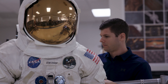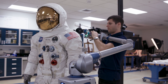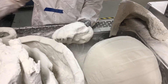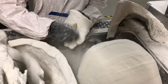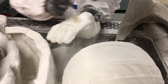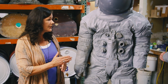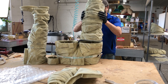This is the monolithic first 3D print, fully assembled, finished, sanded, primed — and after this, it was cast. When assembled, there are actual grooves in each piece that were engineered into the individual parts, so we could have complete 100% assurance when putting it together. You built keys right into the files so the 3D prints could be assembled. And because it was going on to casting, we also wanted to give it additional structural integrity — a honeycomb support structure built on the inside, engineered prior to the build even happening, to make sure the final assembly was stable.